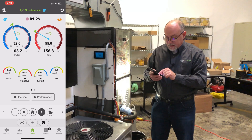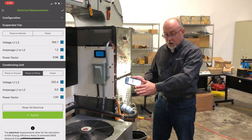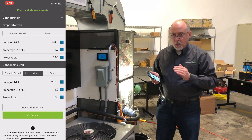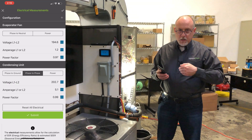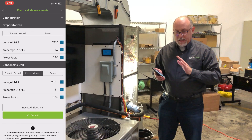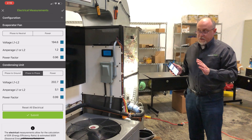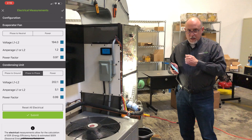I can do a full diagnostic remotely and look at all the information from those ten sensors — temperature split, approximate airflow, volts, amps, power factor — all coming in without having to turn on another probe. Remotely I can start to figure out what's going on with a job. Sensi Predict gives you a ton of information about that specific system, but MeasureQuick puts it in a format you're used to looking at — the same MeasureQuick you're used to — making it much easier to service the system going forward.